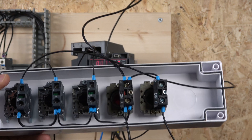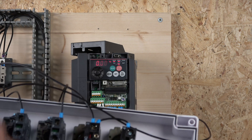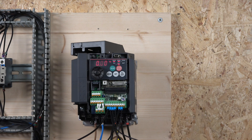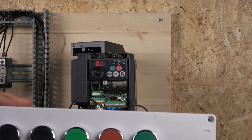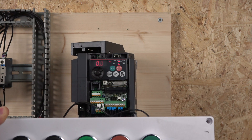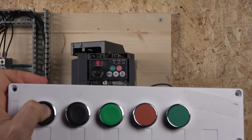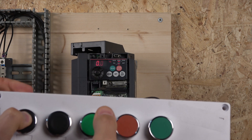The SD signal comes in, goes through the stop, which goes back to RDS — the one we reprogrammed — and from outside the stop it goes to the start signal, which sends back to STF, latching the whole system. Without the enable signal, none of these frequencies will work, so you need to put the drive into run mode first. Then select whatever frequency you want — if you have a frequency selected on a selector switch and click start, it simply goes to that frequency.